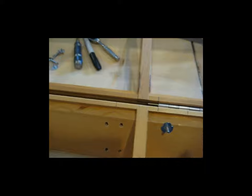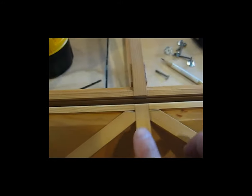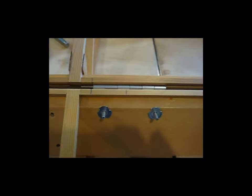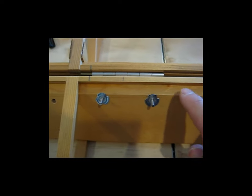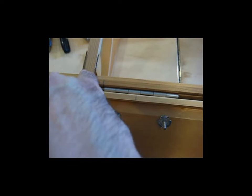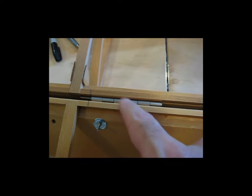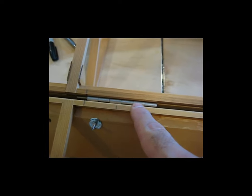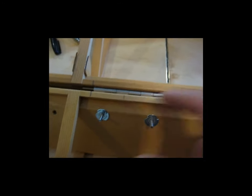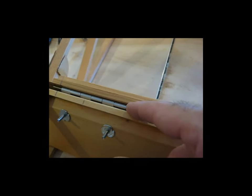To line the aileron up with the wing, you just line up your ribs and make sure they're nicely aligned. I've already got the hinges in place on the aileron — they're bolted in place. I had pre-drilled the other half of the hinge and temporarily installed the wing half of the hinge onto the aileron half using the hinge pin, so the wing half of the hinge is just laying in there right now.